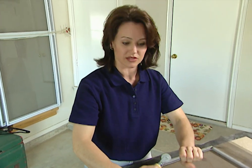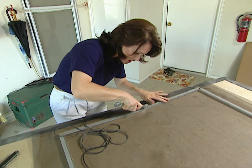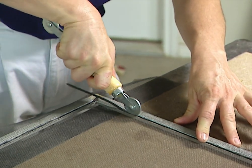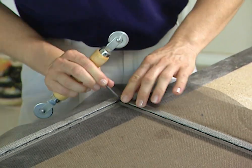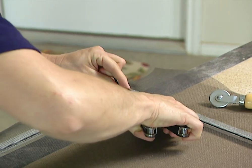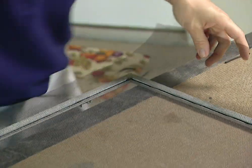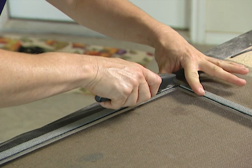So that when we're done, it has a nice tight finish to it. You want to be a little careful as you're rolling this that you don't slip off and tear your screen. I used the old spline and as you can see, I have just a little bit of excess — that's no problem. Just cut that off right there. Then for your excess screen, all you need to do is take a box knife and go right beside your spline and cut your screen off.